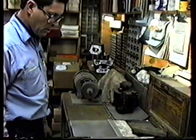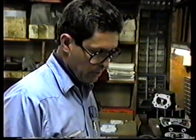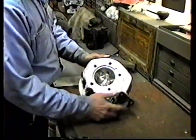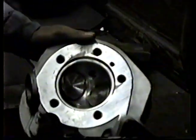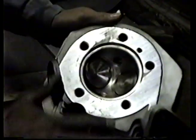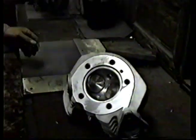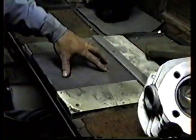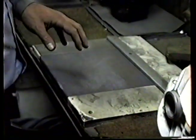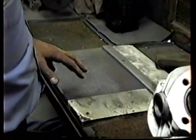We're going to resurface these things. Contrary to popular opinion, the milling machine is not the best way to do it. We've milled cylinder heads on occasion because they had surfaces in really bad shape — burnouts and things like that. They look good on the mill, but then you bring them over here and lay them on this micro-flat — a piece of marble with emery cloth attached — and this is the ultimate flat surface.